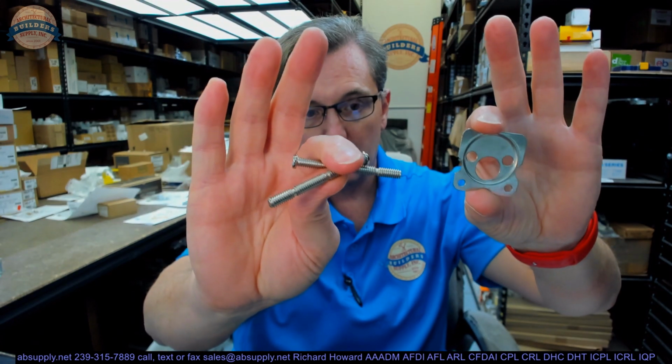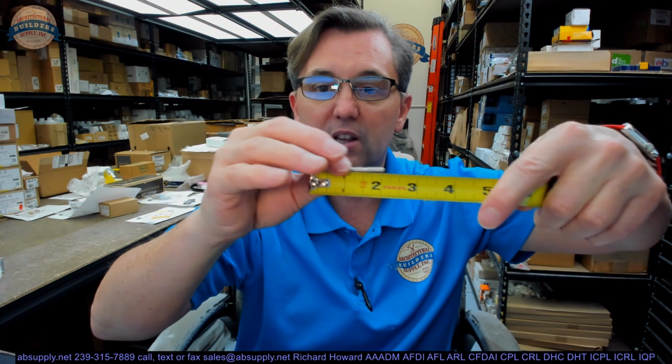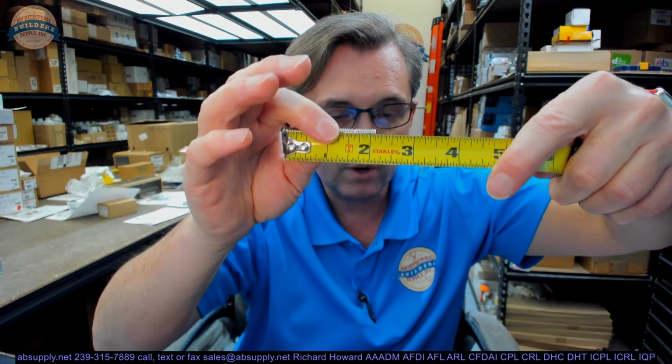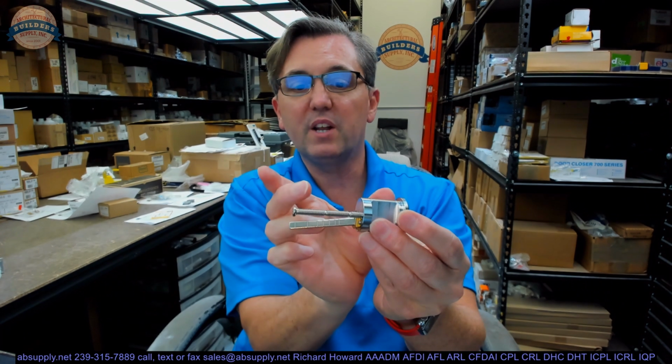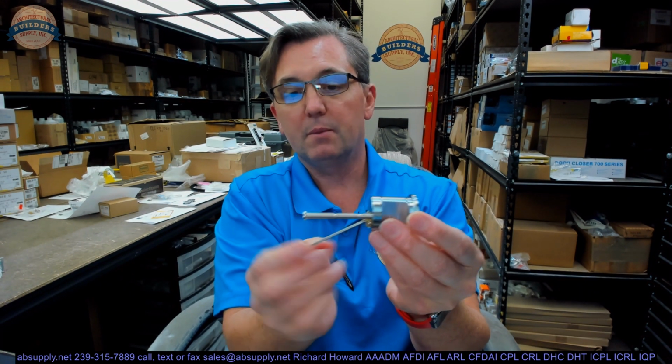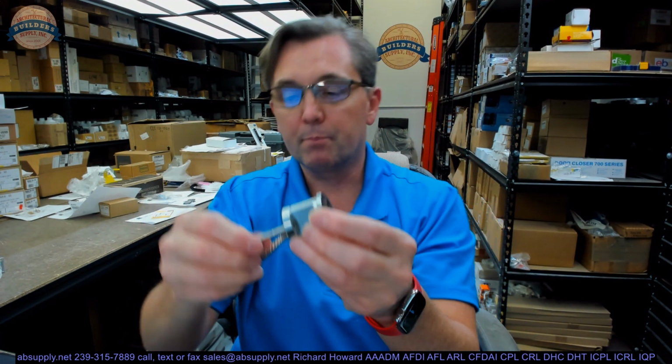Here are the screws. So these are called breakaway screws. They're meant to accommodate different door thicknesses. The length of the screw from the underside of the head is about 2 1/8. That, plus the body, whatever that dimension was that I had mentioned earlier, you get all that together and you're going to be able to accommodate quite a thick door, is the bottom line. The tailpiece has these marks, these breakaway points. The term breakaway is not really meant for you to take it and try to just snap it. It needs to be carefully cut, whether it is the screw, but absolutely the tailpiece.